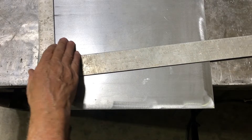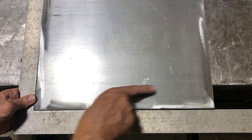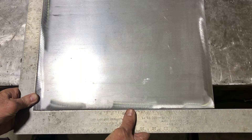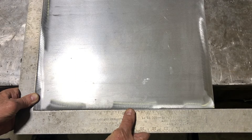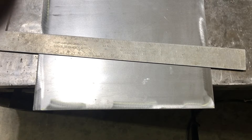After making the adjustment, I've cut another panel and let's see if we've made any improvement. This direction is in X, this is in Y. And you can see we still have a little bit of play, but it is a whole lot better — we've probably taken out 70% of the error. The problem is the adjustment — I'm at the max adjustment. I've moved one side as far back as I can and the other side as far forward as I can. So in order to take out the rest of this error we've got to do something else. Let me show you what the issue is.